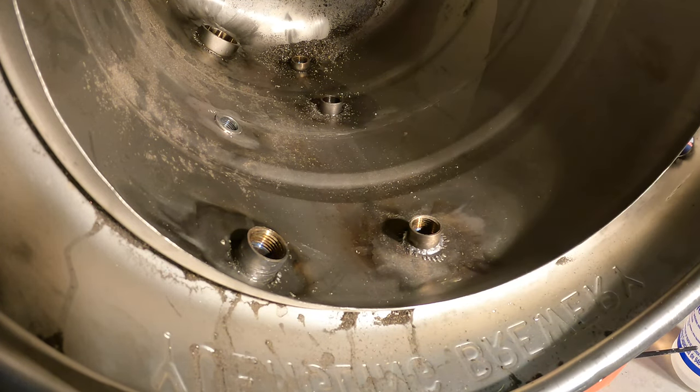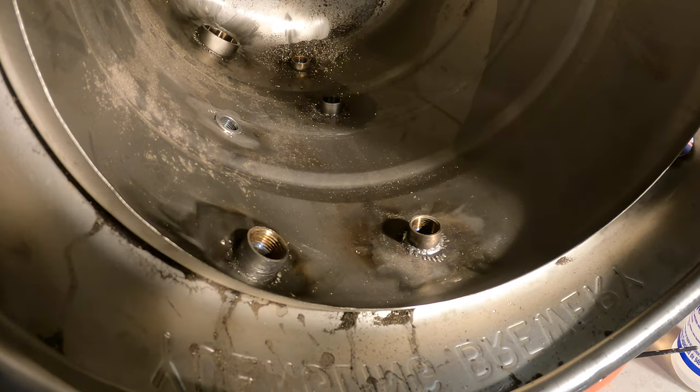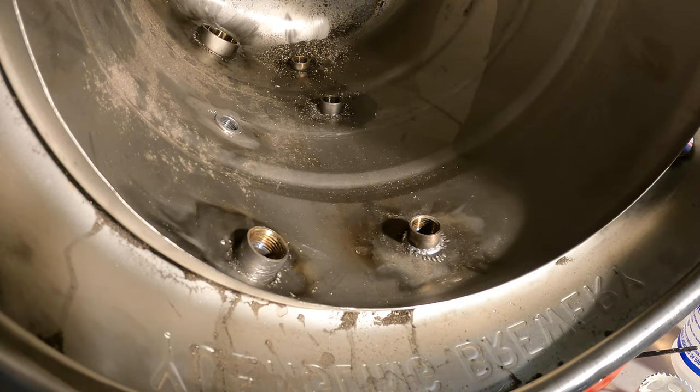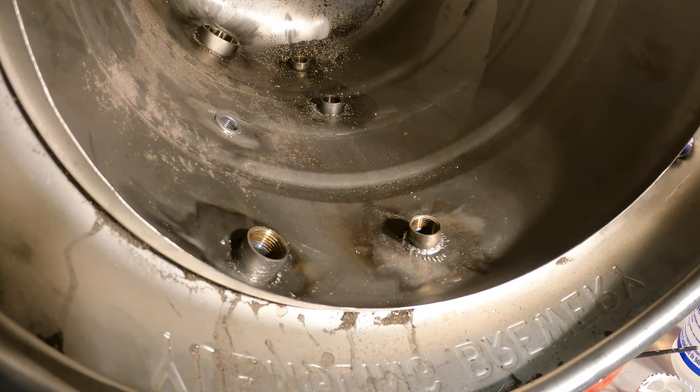So I'm going to repeat the process on all the fittings, even the big two inch tri-clamp fittings. What I'm going to use for that is, I drilled those holes with a 2 1/4 inch hole saw, so I have a 2 1/2 inch hole saw laying around. I'm going to use that also. Same process: make the bead of solder, put flux inside your dimple groove, and then just heat it up from the bottom, hitting the actual fitting, and you're good to go. So once I get that done, we're going to move on to cleaning these out and plumbing it up.